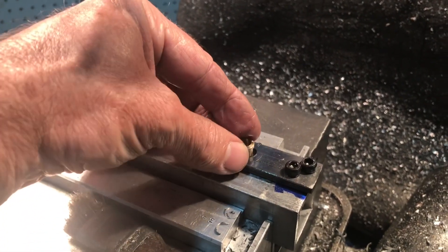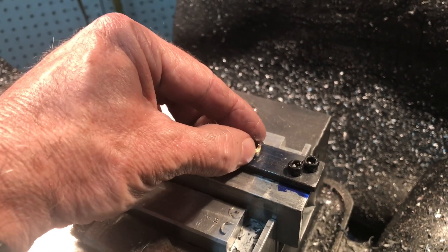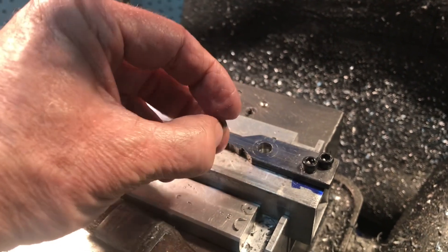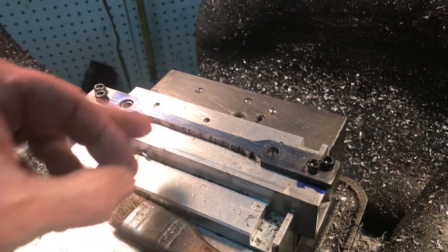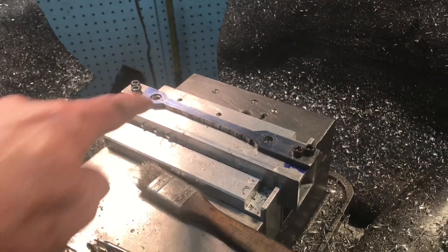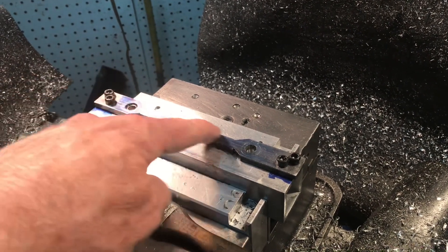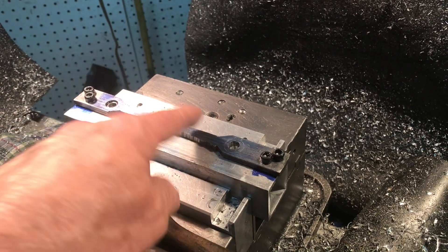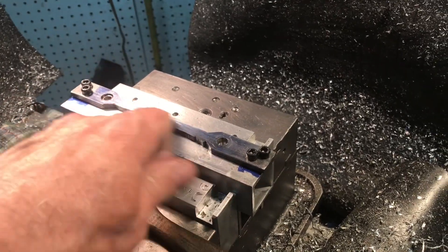The holes are drilled and reamed. I've tested it by just lightly sticking the bushing in there — I don't want to push it all the way down and have to fish it out before I start the milling. The rear bushing will fit, and I've already tested the front bushing. So now it's time to swap out the drilling head, put a milling cutter in, and mill out the profile first. I'm just going to do the interior portions, go down to the scribe line and smooth that all out, and then twist it to thin this portion out as well.